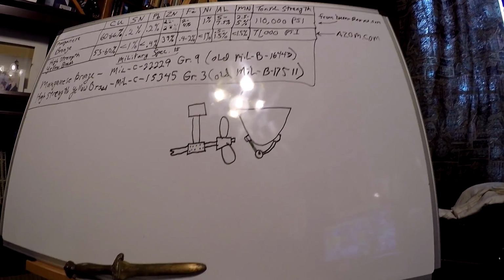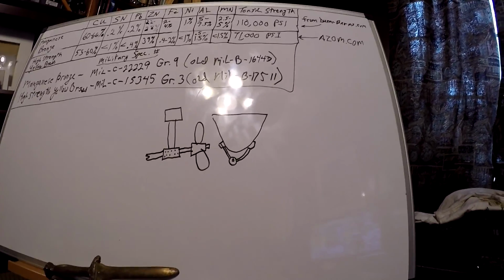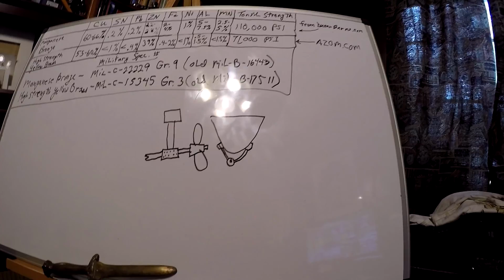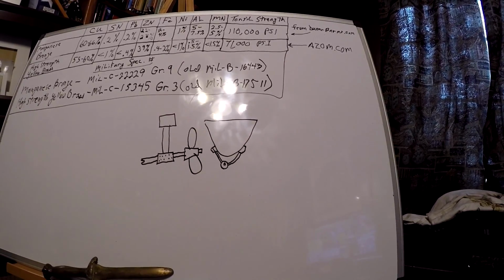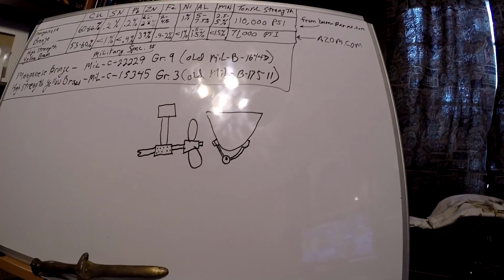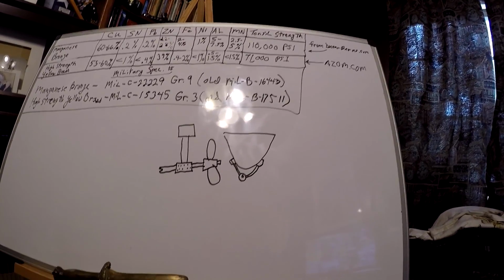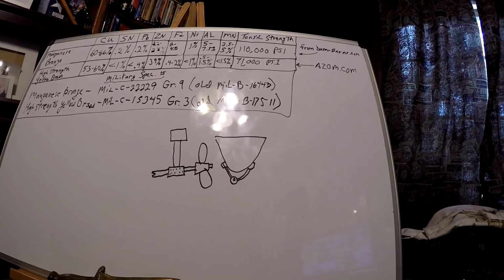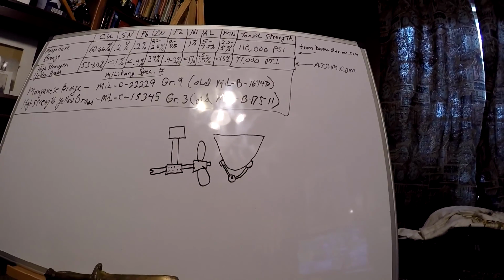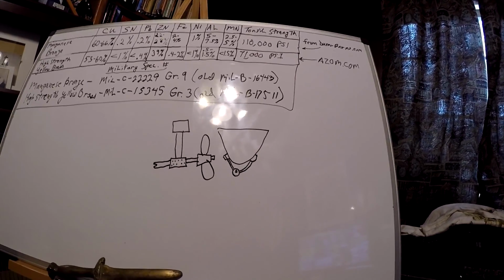And when they made those struts, that's the name, I knew it would come to me sooner or later, struts, just like what I read, you didn't have to hardly do anything to them other than just get rid of the flashing or the excess metal that might be on the outside edges, and it would be pretty. They never bothered to paint them because they had their own oxidized surface that wouldn't go any further than that. You know, it would only get just so dark, and then it would stop. Corrosion would stop at that point.